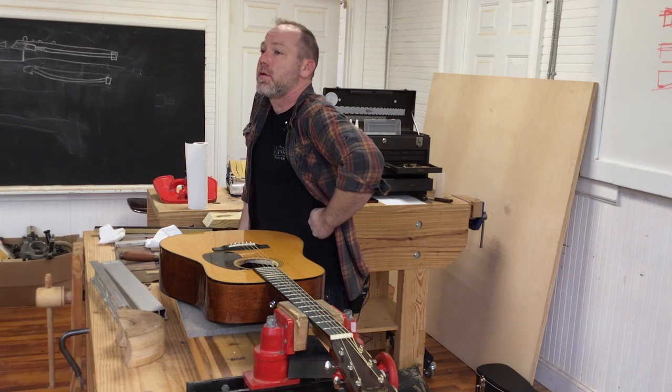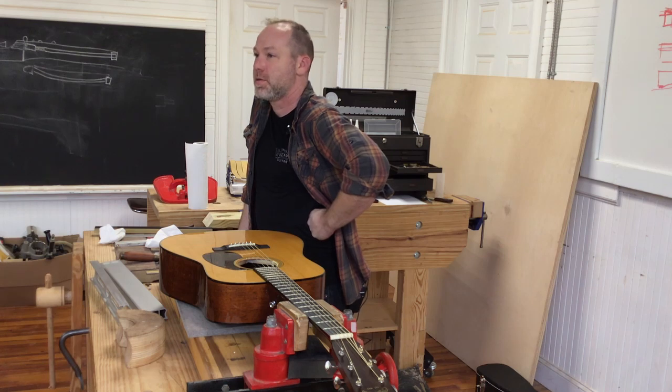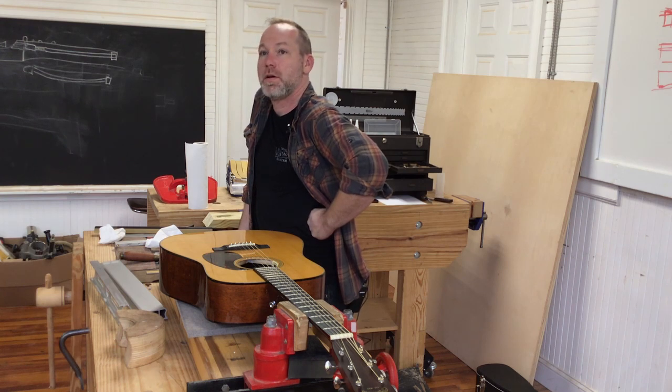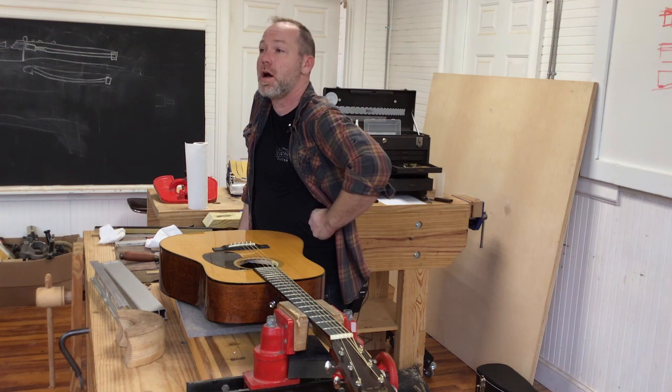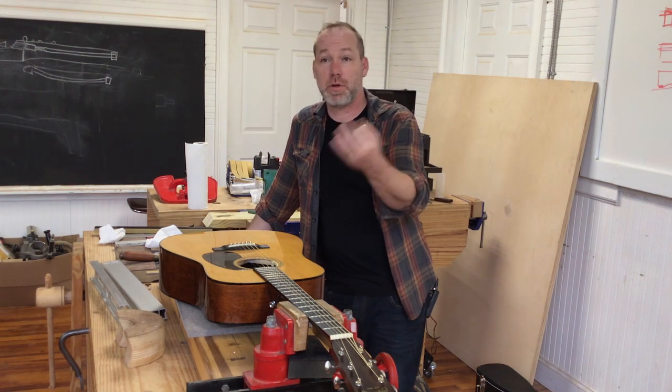There's a substitute for an expensive glue pot. I think the Stew-Mac is what, $200 now, something like that. The little pots that students used to carry to college with them to heat tea and everything, perfect 140 degrees. And you can find them at antique shops. They also make those mini crock pots, have you seen those? Can you use one of those too? Get a meat thermometer and put it in there.